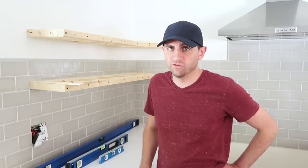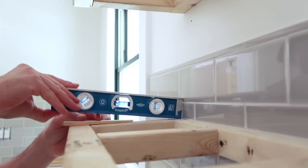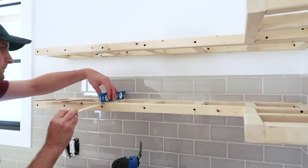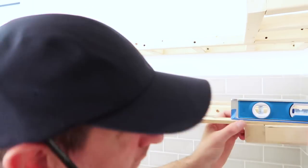Tiling is complete. The next step is to skin our shelves with furniture grade plywood. Any imperfections in the lumber or the mounting process, we'll be utilizing shims to counteract that, so make sure you check your level both top and bottom. Once that is complete, we will skin the fronts with select pine and it will be all set.